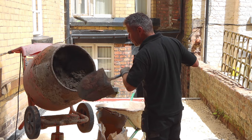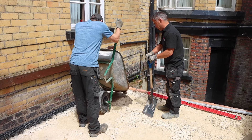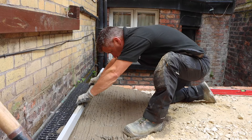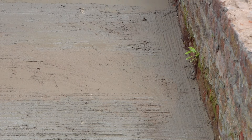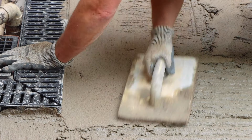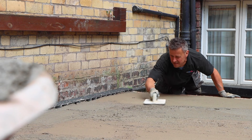I'm mixing up a very lean concrete screed, laying it around 40-60mm deep. It's a mixture of ballast — a combination of gravel and sharp sand mixed with cement — tamped heavily with a straight edge. Once it's dried for about an hour, I can start to buff up the surface using a plastic float. This is going to be left for a minimum of three weeks to dry, then I'm ready to start tiling.